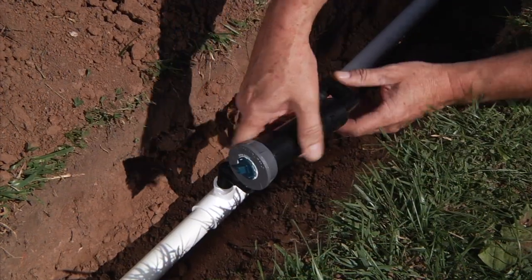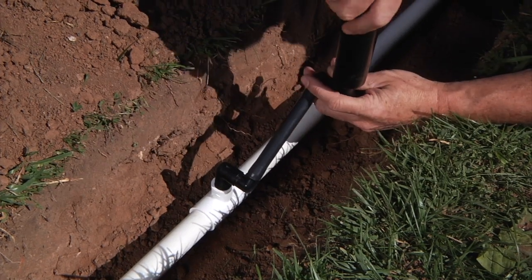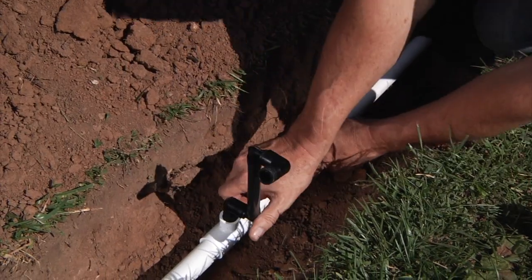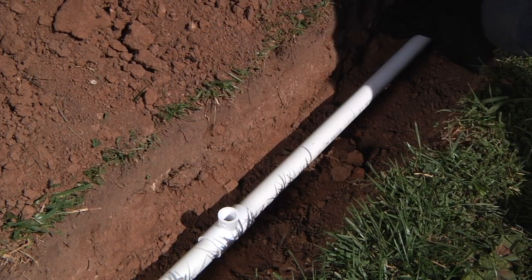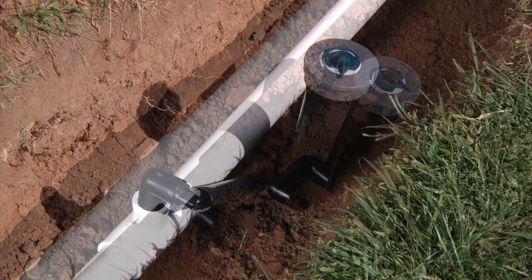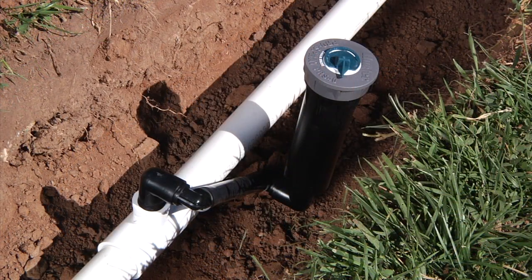As well for service down the road, having the T facing upwards allows you to spin the swing joint vertically and very easily unscrew it to reinsert a new one for service. The Hunter Swing Joint can be mounted vertically or sideways, but for best practice and ease of maintenance, you'll want to mount the T in the vertical position.